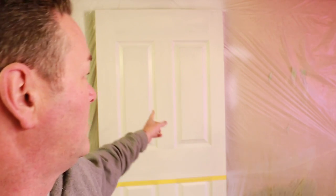Today, Scott at Paint Monster has supplied me with some rollers and brushes. These are Nor rollers — I've got one of these little four-inch frames, on the chunkier diameter. I quite like these sorts of rollers because when you're doing doors, the circumference of the rotation is a little bit more than the traditional four-inch rad roller. That small diameter sleeve means you've rolled over the surface before you know it and you're wanting to load up again. So today on Doris the door I've given it a nib down and a dust down.